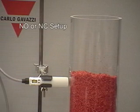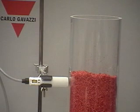Now for our final step. Step three is for selecting between normally open or normally closed operation. Press the button or connect the teach wire for nine seconds, until the LEDs are flashing at a rate of three times per second. We will then release the button or the teach wire, and now we've toggled between a normally open or normally closed operation.